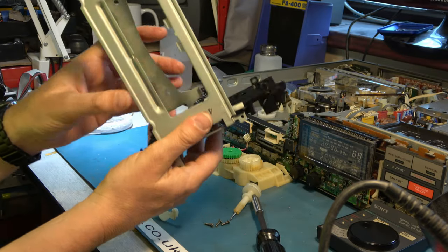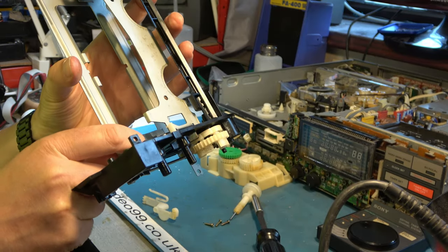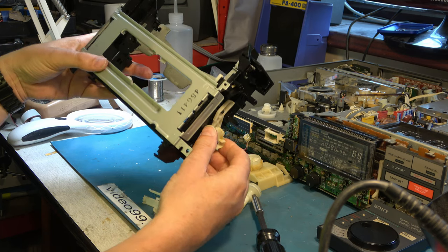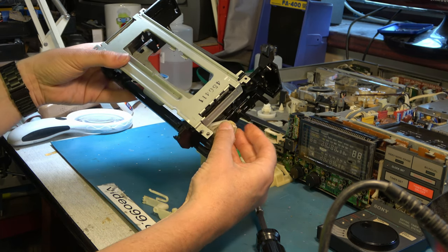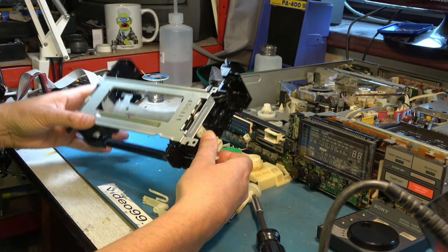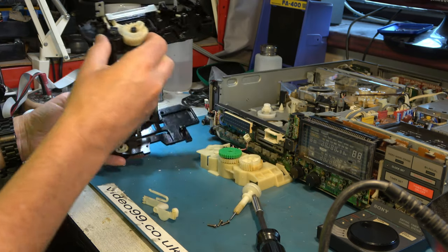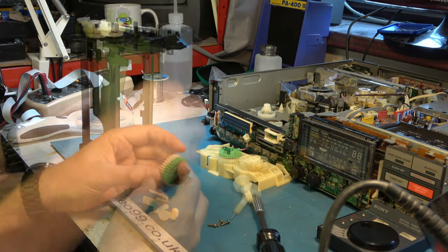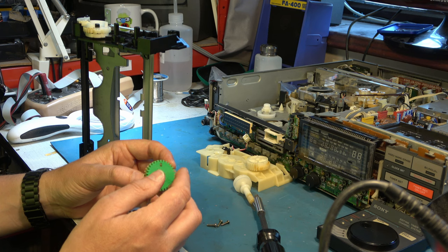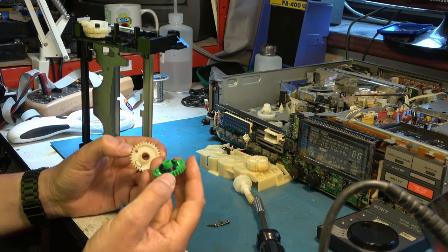You can't just push it in, you have to release a trap. You get these traps on a lot of VHS decks as well. It stops it from going in without a tape. That looks right now. So there's the trap, you need to pull it out of the way. Well, that's looking fine now. Let's see if I can reassemble it. What doesn't feel right is this. I'm sure the spring inside this is supposed to load that. So something's become disconnected in here.